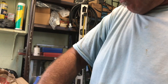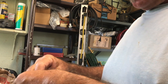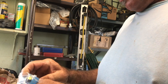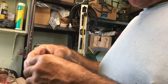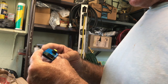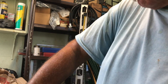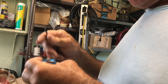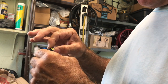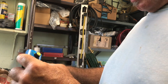Yeah, and I'm not going to use radio to control them. They're going to be hardwired because you don't want to go by somebody's drone and all of a sudden go to full throttle because they're on the same channel. I'm going to hardwire them and use something like this — just a servo tester. You hook power up to it, plug your servo in, and then the servo should just mimic the position of this rheostat. That's all I need.